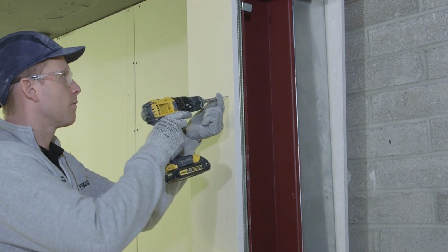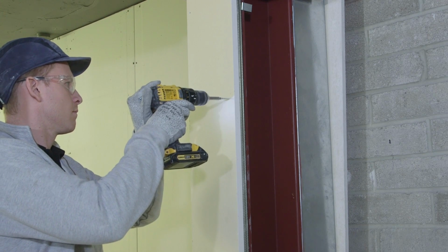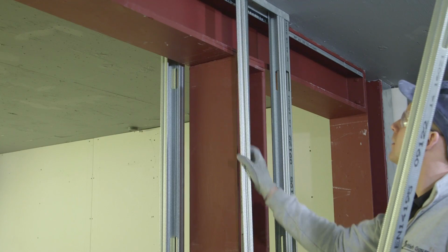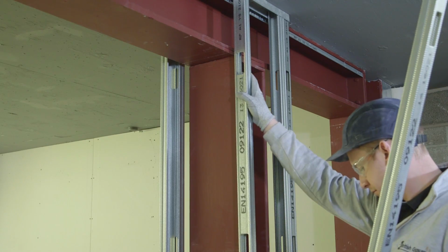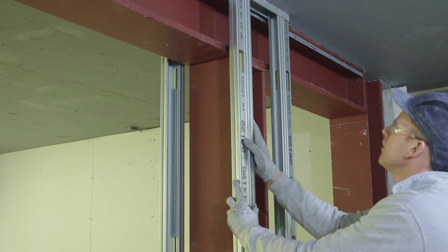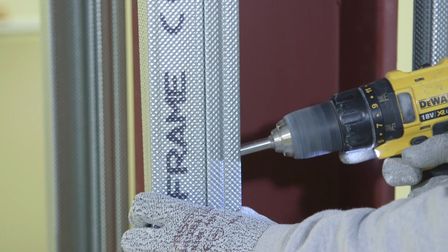Where 3 hours of fire resistance is required, GlassRock F firecase boards are used in conjunction with the GypLyner Encase system. Boxing out of steel columns can be done with either Gypframe I-studs or metal studs, as demonstrated here, where 2 studs are fixed together at external corners.